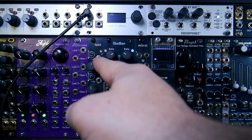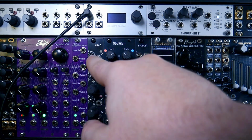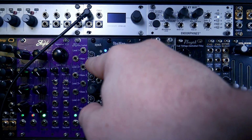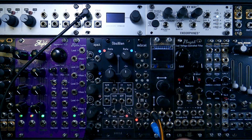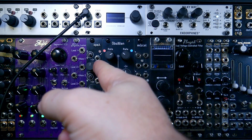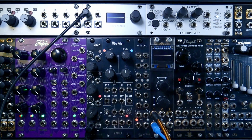So we could do offsetting real easy, or give manual control to certain CV inputs like we'll see in a little bit with Obsidian. You have a destination of 2 different outputs, X or I'm going to call it Y. I think that's a lambda. I don't quite remember since college. Or you could set the switch to the middle and it routes it to neither output. So it's a good way to silence it since we have attenuators here and it's really hard to get to absolute 0. And you'll notice there's this 2-times switch at the bottom here, which will not adjust the CV built in there, but it will take your audio and double that voltage.